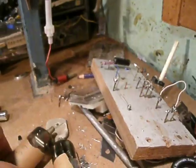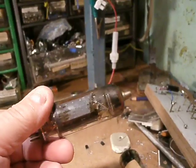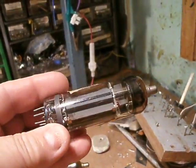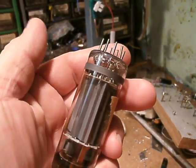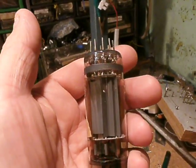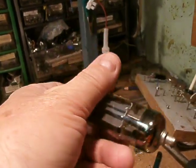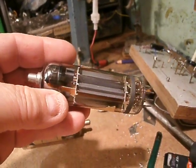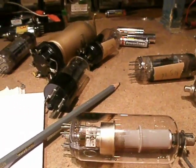Here also old tubes from television sets, from the 60s. Also a rectifier tube. The P indicating with the P — the European tubes starting with the P — meant that their filament voltage was higher than 6.3 volts; I think it was approximately 16 volts or so. I have to study that in the tube book.